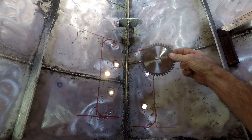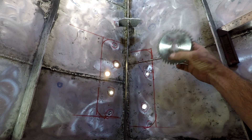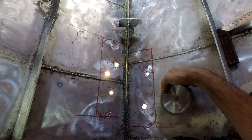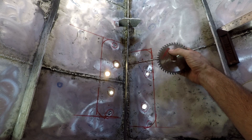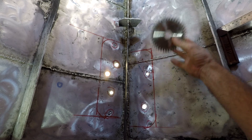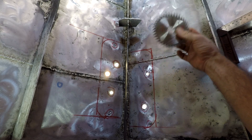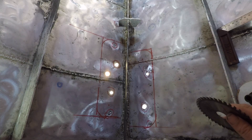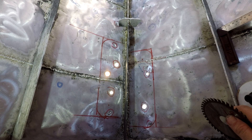In my hand is the correct tool for the job — I call it a meat axe. It's a circular saw blade that goes on a high-RPM angle grinder. I almost killed myself with this about a year ago and I will never touch it again. It's the perfect thing because you don't want to contaminate the weld site — carbide tips like a circular saw and you just take it out. But it bound at the corner, went flying, and it went through my toe. So my compromise is to use a jigsaw and hole saw instead. What you don't want to do is use grinding wheels with the black aggregate ones — that's going to contaminate the weld site.